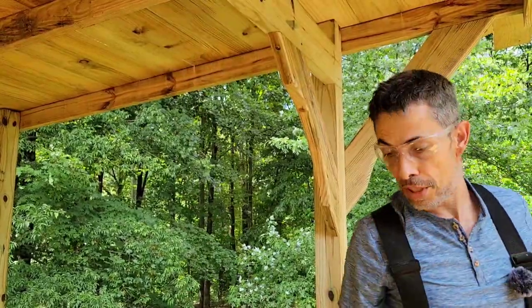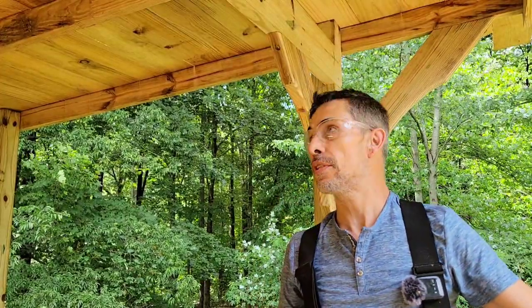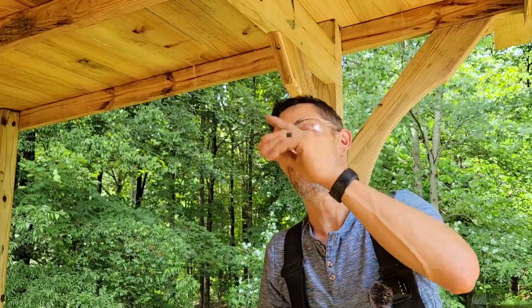All right, so those are done. It's time to move on to the roof part. So I got to get those boards cut off from the top, and then we're going to start putting some blocks in here. Remember, we guys talked about putting our rafters. We kind of symmetrically set them so they weren't exactly on 2 foot, so that may cause a problem with the seam. However, I'm going to make sure it doesn't cause a problem because I have enough to overlap it good, and I'm going to run some blocks this way to make sure I'm driving screws down through 2x4s. I want this thing to be tight, holding on good. All right, guys, that's the plan. I'm about to get up on the roof. Holla.